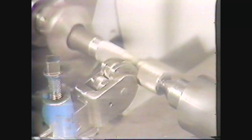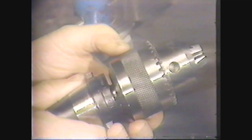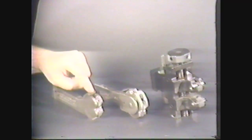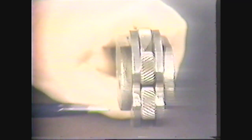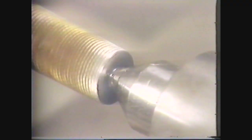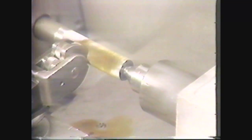Let's review the material covered in this videotape. Knurling is used to improve the appearance of the surface of a workpiece. Diamond-shaped knurls provide for better gripping, and straight line knurls slightly increase the diameter of the work for press fitting. Knurling tools are classified by types: knuckle joint, revolving head, and straddle; by pitch: fine, medium, and coarse; and by pattern: diamond shape and straight. Knurling should be performed between centers whenever possible. This method of holding the workpiece provides the best support to withstand the horizontal pressure applied by the knurling tool.